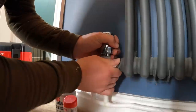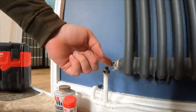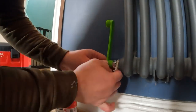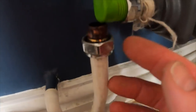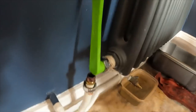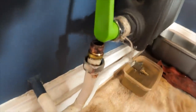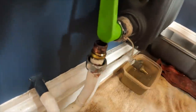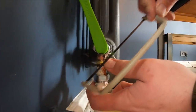We've dropped the system out and it's just holding its vacuum now — just drooling out a tiny bit. That means we can whip this valve off. I'm going to take that out, remake it, and put some paste and possibly PTFE tape around these fittings. With the bung in we can just disconnect this — we know we're going to be all right. Just a little bit of water in there. The plumb thumbs come in handy for that. This is completely dry, so we'll pull the nut down. No paste or anything on it, so we'll get some paste on it. I haven't got an olive pulling tool — I think I lost it on a job — but if need be I'll cut the side of it with a hacksaw. We'll do the old school trick to get the olive off: just cut a diagonal line, not all the way through.